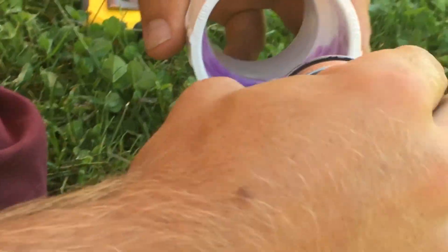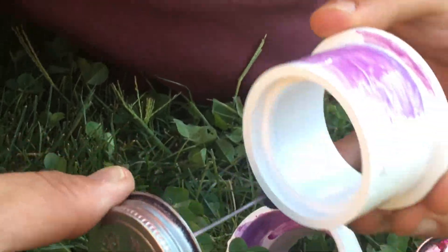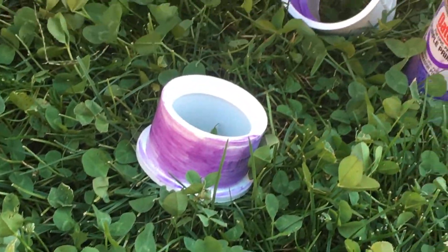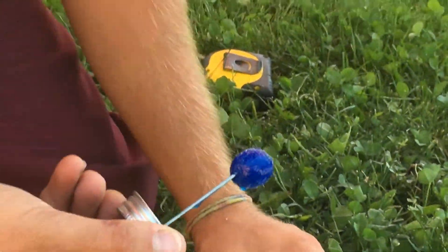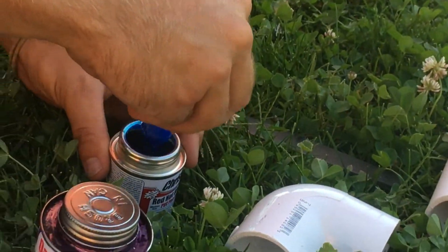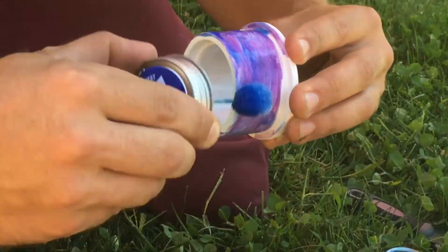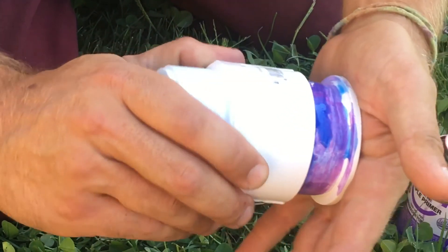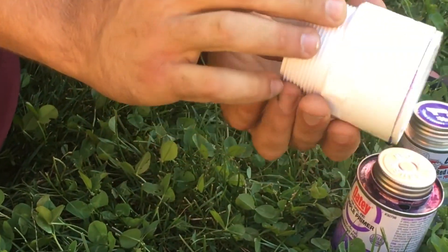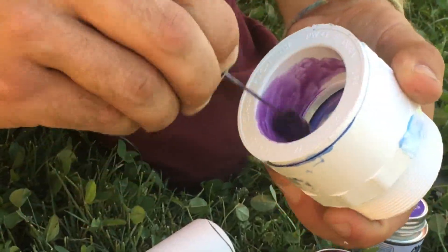Please don't inhale the blue glue — it's pretty bad for you. It looks really tasty, but it's actually very toxic. You can see I'm putting the primer on first and then adding the glue on top of the primer, just one after another. You want to get as much glue on there as you can for a really tight seal — the more the better. Give it a slight twist when you put it in; that's actually going to create a better seal, getting that full compression fit.